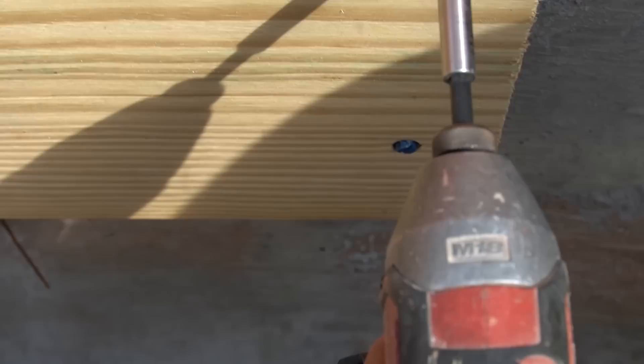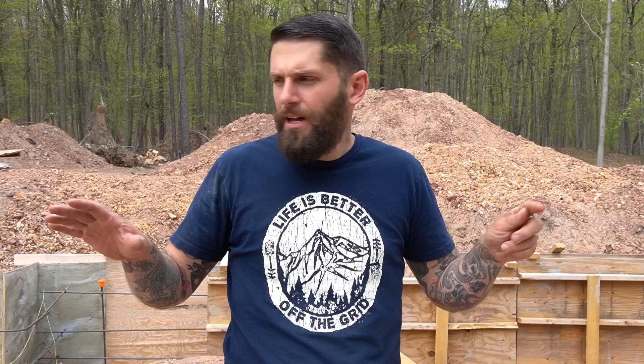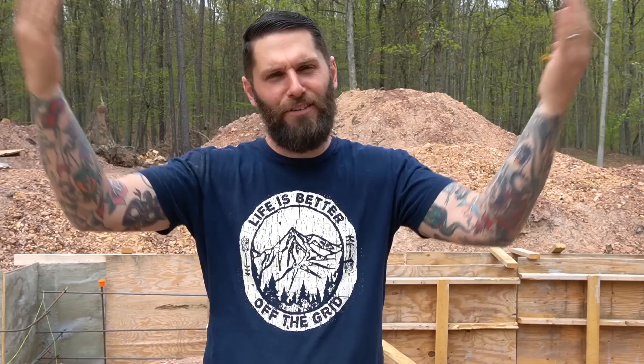Checking that she's on the line — confirmed good. So our span is roughly 40 feet across and our 2x12s are all 16 feet in length. We'll start out with one 2x12x16, have two of them butt up together, and take a third one to sandwich them on the other side right in the middle — so it's 8 feet both ways from center where two 16-footers come in. We'll put it right on the red line, right to the edge. Perfect.